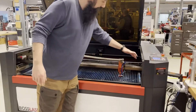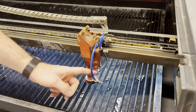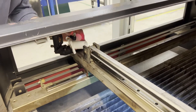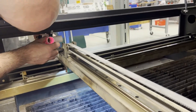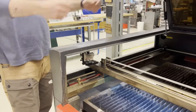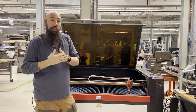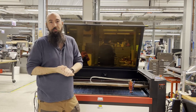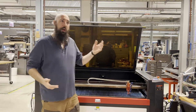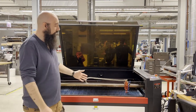The first thing I did is add a tap to the head just beneath the mirror to keep a positive pressure — it uses the same air that is used for the air assist on the nozzle. Then over on mirror number two, I have this air pressure jig here, currently detached, which just snaps right over the cover and allows positive air pressure to shoot on both sides. So now there's no more dust or particulate landing on that lens. The energy of the beam coming through can sometimes cook dust into the mirror — and they're fairly expensive, somewhere between $50 and $90 depending on where you're buying them — so it's a lot of cost savings and a lot better for the members so they're not wasting material finding out their settings weren't right on the first cut. Follow me while I install all this and you can see what everything looks like.